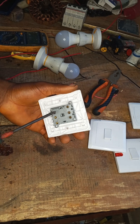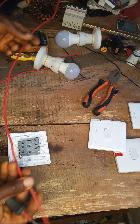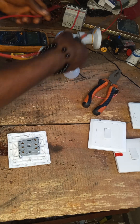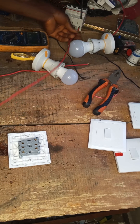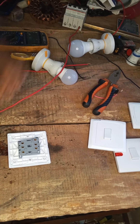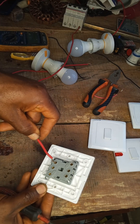From this common terminal we loop to the second terminal. Now we use this wire to connect from our breaker to this common terminal. So let me connect from our breaker to here. This wire is from our breaker and we connect it to the common terminal of this one.